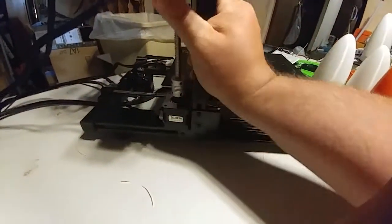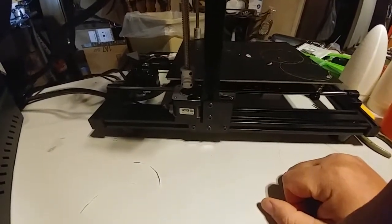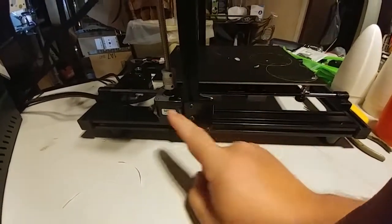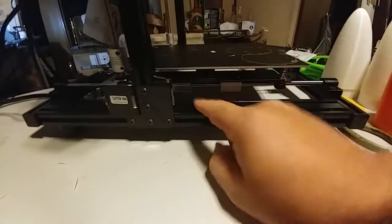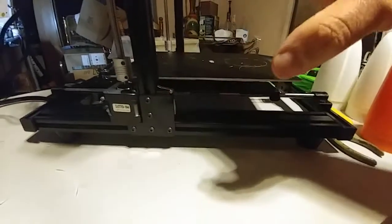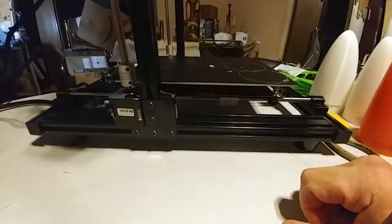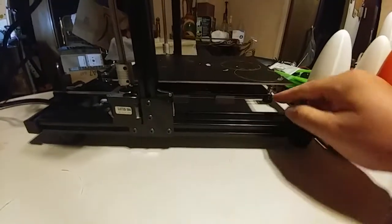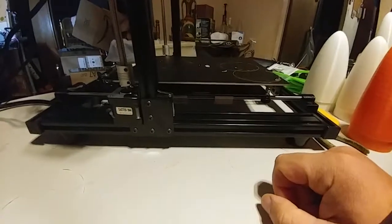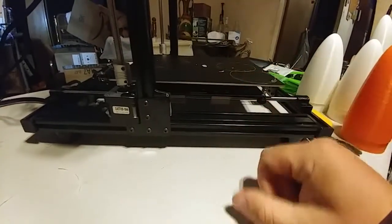The reason this crash occurs is not because of a design flaw — it actually clears. Mine did not hit it once I corrected the quality control flaw. But the tolerances are so close that one of the QC flaws causes the crash problem. On almost every printer I've seen on video, the H-brace is bent. These back arms are actually bent down a little bit, which brings the leveling knob down, allowing it to crash into the molex connector because they are so close together.